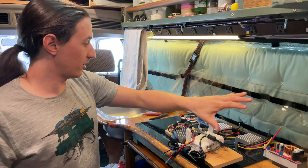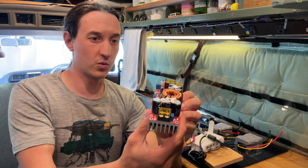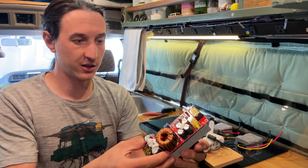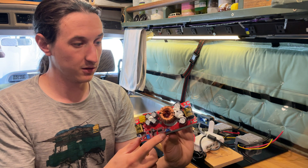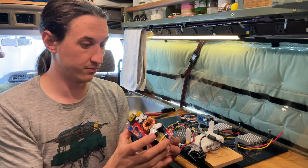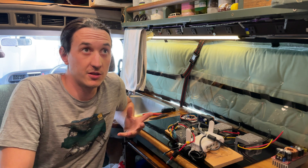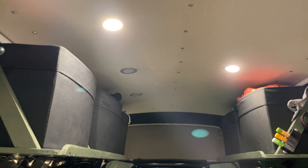I have an array of power supplies here. Something like this will work — it's definitely got the capacitors and the inductive coil — but I'll have to tune it manually and it's a pretty big thing, so I'm hoping I can return it. But the big problem with the noise is that it has killed my LED lights. I don't even have the Starlink dish on right now, and that light is flickering.